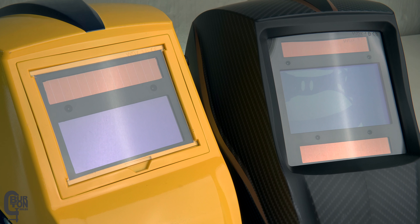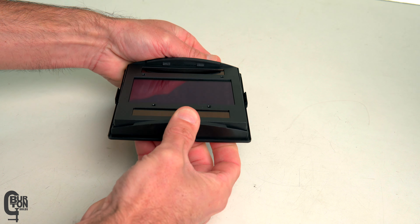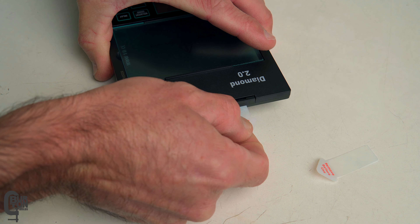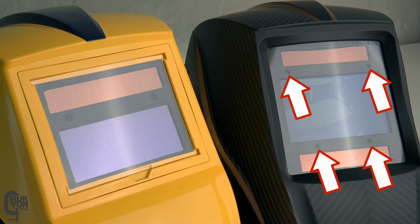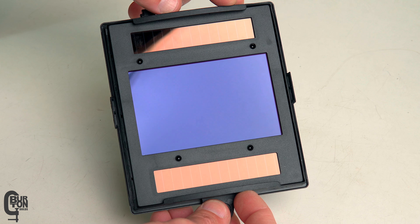Now let's have a quick look at some of the specs and features. Most welding helmets run off a solar cell, and this helmet has two solar cells — one above and one below the filter screen — and it runs on twin CR2032 batteries. To replace the batteries you need to take out the filter and remove it from the hood. It also doesn't have any external controls compared to the previous generation which had the shade setting on the side. I actually prefer having the shade setting inside the helmet because I've sometimes bumped the shade dial accidentally and ended up making myself as blind as a welder's dog. This helmet also has four arc sensors — most helmets have two — so if you block two of them in a peculiar welding position, you won't get arc flashed because the other two are still working.